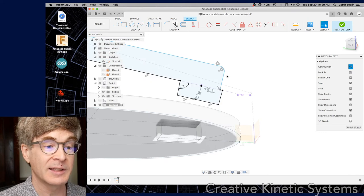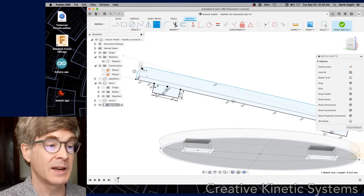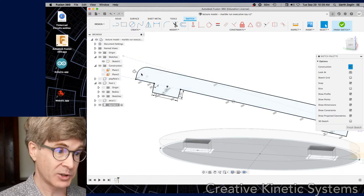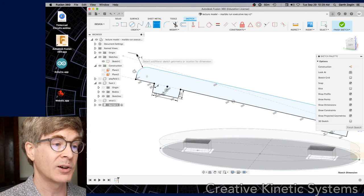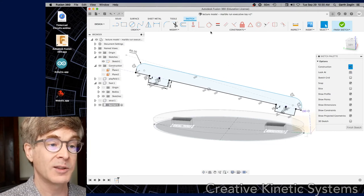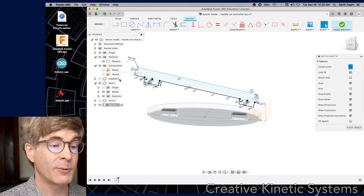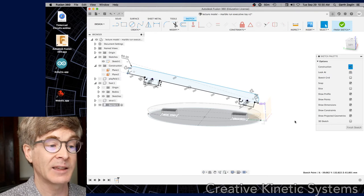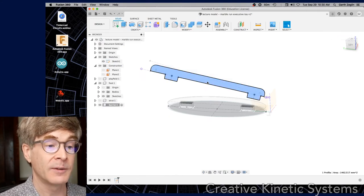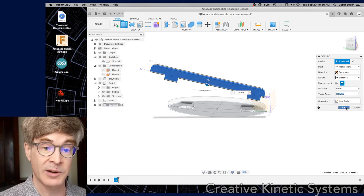All that's left is to enforce the symmetry here — I'll just type in the 88 again. Then — the curve ended up not being tangent, so I'll fix that right now: make the little arc tangent there to get a nice curve, then add symmetry for the roots of the tabs on the center line. That's at least a viable tab, but we want this to extend a little further down, so I'll drag it more into place. I'm going to pick a radius for the curve — six millimeter exact radius — and put an equality constraint so the two curves have the same radius to keep them uniform. I have a remaining freedom in the part but I don't need to worry about the exact length right now. I'll finish the sketch and extrude: two-sided symmetric, full width of six millimeters — and I get a body.